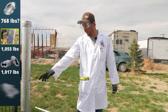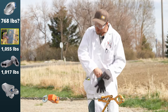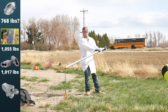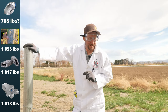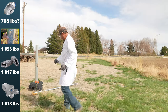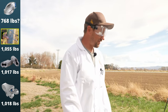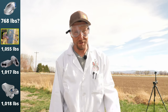Now we're gonna test the T-gripple. Right now we're sitting at 402 pounds... 881... 1018. Let's go look and see where it failed. It was not the T-gripple — right behind the chainwalker again. Two thumbs up if you don't want to tie a high tensile knot, or if you're like me and just don't have the artistry in your blood to do so.